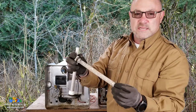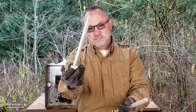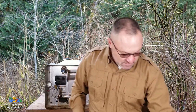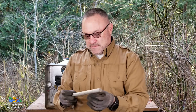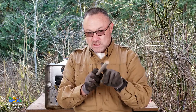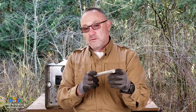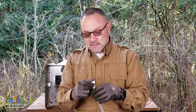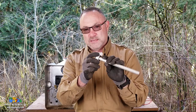So it's like a Jesus rod. It's going to sacrifice itself so that you have hot water. So this is it new. This is hardly used. I would still use this one. But we've pulled these out of water heaters where it's just a stick sticking out, like a corn dog stick. And then we've even pulled them out of water heaters where the stick has even been rusted out. And then we've even done them where there's just the plug, it's starting to eat.